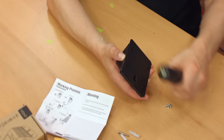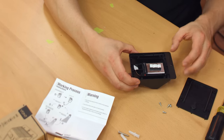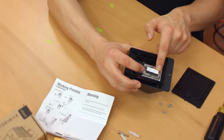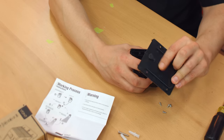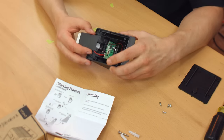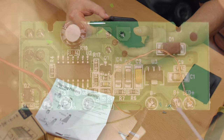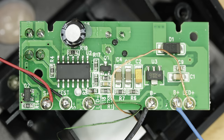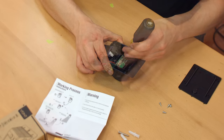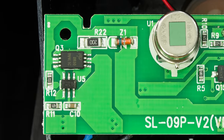The back is held on by four screws with heavy threads driven into the plastic of the case. With the screws out, the back falls right off, and there is indeed some waterproofing in the form of a U-shaped gasket set into a channel surrounding the internal components on the top and sides. A medium-sized flat lithium cell under the cover is held firmly in place by the pressure of the cover against a foam pad. You can see indents on the foam caused by the ridges on the inside of the cover plate. Under the cell is a very small circuit board with extremely fine wiring, especially those going to the LEDs. The circuit board has notable components on the front: the passive infrared sensor, the power button, an 8-pin chip, and a 6-pin chip.